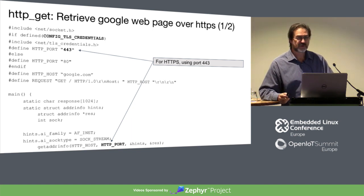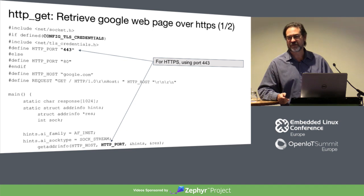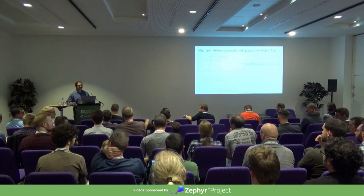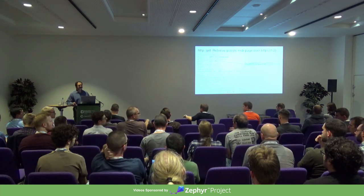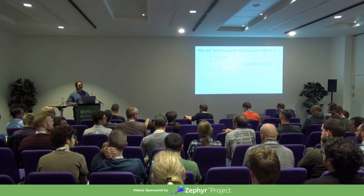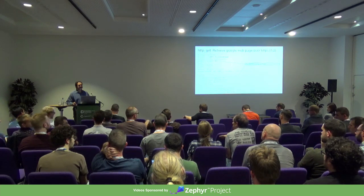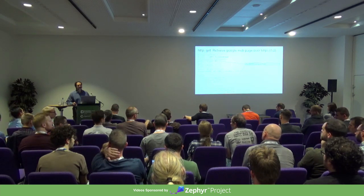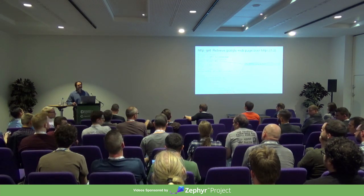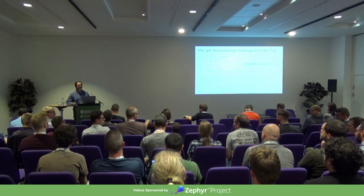On the other hand, we have this network processor with certain capabilities, and we haven't really entertained that thought. Well, it seems like ostensibly it's a network processor, it also has Wi-Fi functionality, so it's got an upper MAC and a lower MAC. There's a lot going on in there. They've had this chip for a long time, but they're trying to enable Zephyr for application development on the app side of it. So there's not a real benefit on an existing platform to do that. Now maybe on a new platform you would consider a much tighter integration of Wi-Fi with Zephyr.